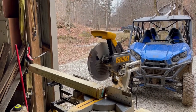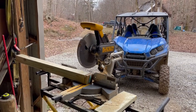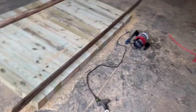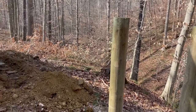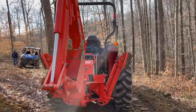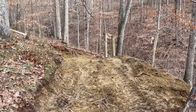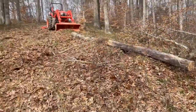All the cross members were cut — four by fours — with a saw, making sure they were all four foot. A router was used to wrap the groove for the cable, using a guide board for that. With the backhoe, the anchor holes were dug, which are about five feet wide and four feet deep, and a pathway was dug to the other side.